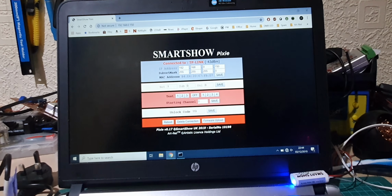So the net and the sub and the universe are what you would use in the software for when you're talking to it through ArtNet. We'll have a look at that later on. Test 1, 2, 3 is for testing RGB, and 1, 2, 3, 4 is testing LEDs that are RGBW, which is red, green, blue and white. If we're using this in a chain of other LEDs and controllers, and we want to start our channel at a particular LED, we can use this, change the starting channel there.